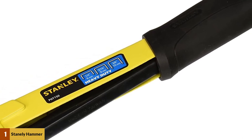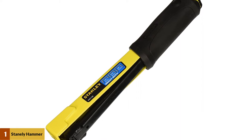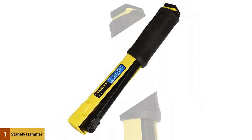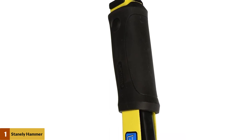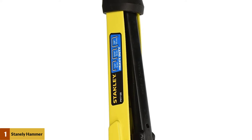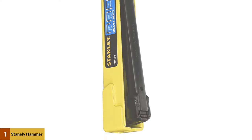You can load it with the Sharpshooter TRA700 or Arrow T50 staples, and it can hold two full sticks. Overall, it's a good stapler, but it has some performance issues. You should keep pliers around in case it jams, and you shouldn't under any circumstances try to bang it. This hammer staple tacker works best with 1/4 inch staples.